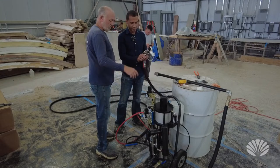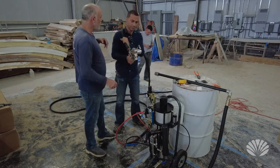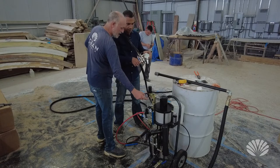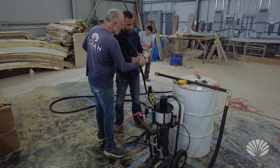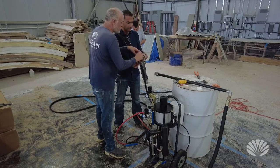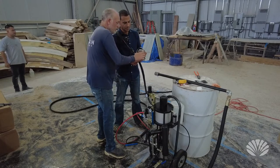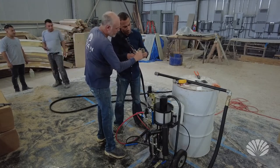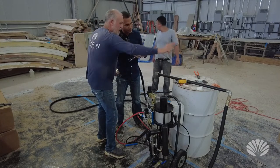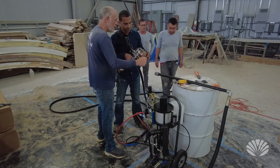How does this work? There's air pressure that comes in — you put it on your shoulder. The resin and hardener come out, and we adjust the speed of the mix. Instead of mixing in the line, it mixes on the surface. We have a double string woven fiber that comes through into this spool. Inside the spool, cutting blades go up against a rubber wheel, the fiber gets chopped, and air blows it out onto the surface where it mixes with the resin and hardener.